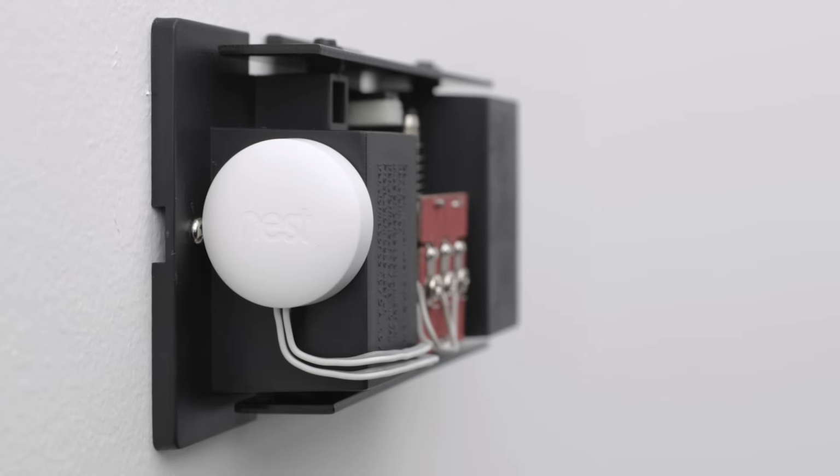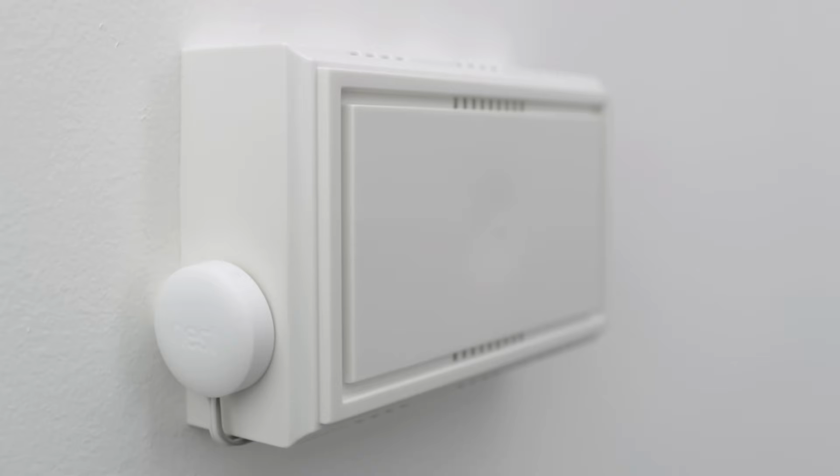If you have a mechanical chime with moving parts and it didn't ring or didn't sound right, remove the chime cover and check that the wires aren't touching any moving parts. Then test your chime again. If your chime still doesn't sound right, try installing the connector on the outside of your chime cover.